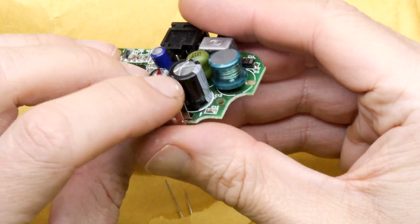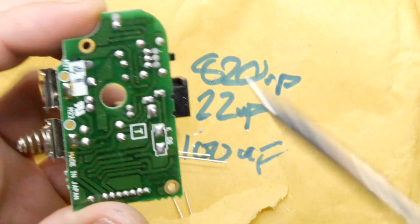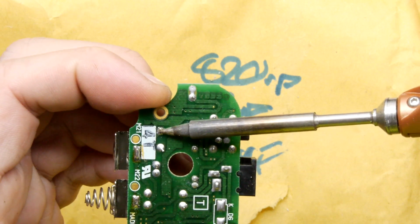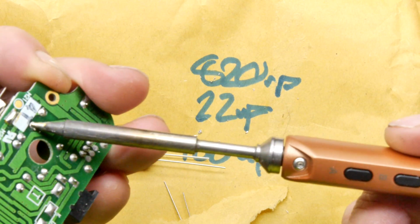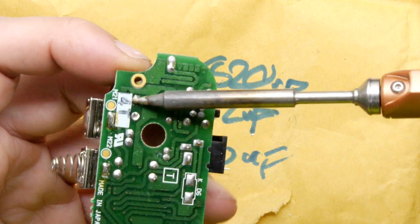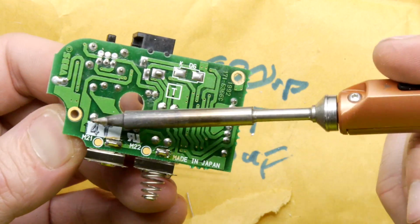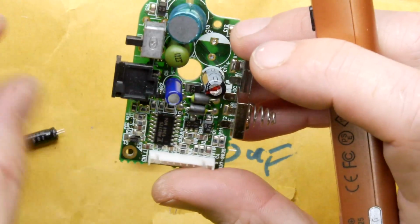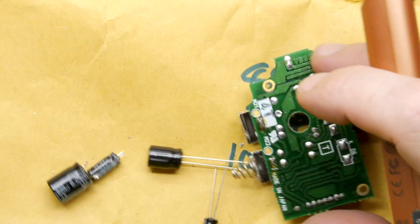And let's take up this big old bad boy here, because it's got slightly splayed pins. They've had to splay them to make sure it didn't go AWOL when they were trying to fit this. So I'm just rocking it slightly, applying a little bit of pressure, but it's hitting into the components next to it. So I'm putting pressure now away to the edge of the board. You can see it's poked through. Don't force it too much, or you might rip out the pad and the via, and that's a whole mess of work you don't want to get involved in. And there you go. Should have paid attention to where it's positive and negative, but fortunately, again, it's marked on the board. Nothing to worry about there.